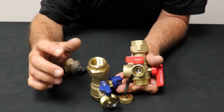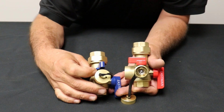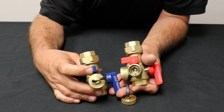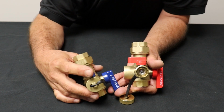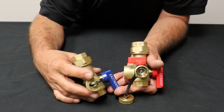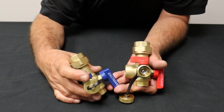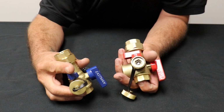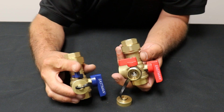Your little display, your little controller, will actually tell you that it's got some scale buildup and it is time to clean it out. It'll flash a CO. I think some of them say 00, some of them say 99. Look at your homeowner's manual. Go find the PDF online and read about your error codes.